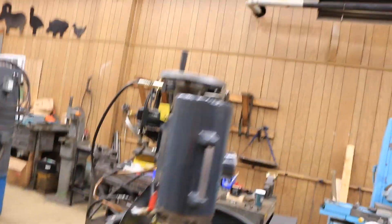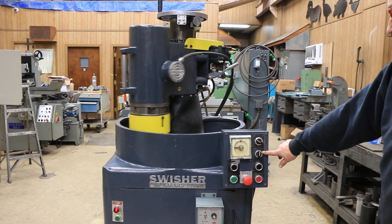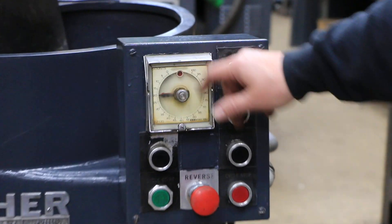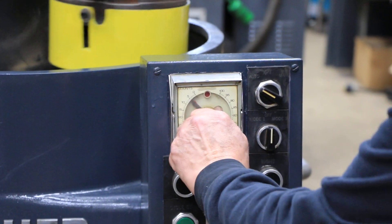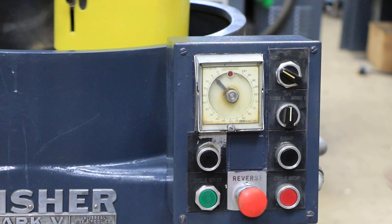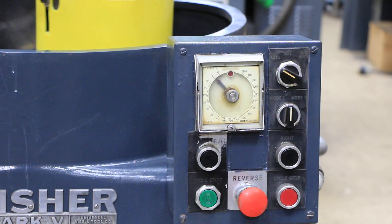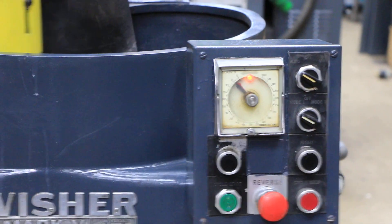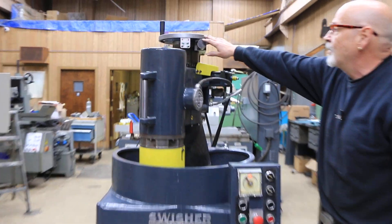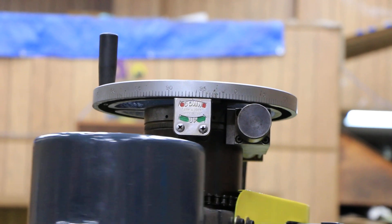When we walk around to the front of the machine, it's going back and forth, but it's not feeding right now because I haven't selected the downfeed mode. There are two downfeed modes — remember we talked about this. The first mode is going to feed; I don't want it to feed 20 times, so let's go up to five. And the other mode, it's going to go back and forth five times before it feeds. So now we're going to feed every time — it has to go there and then back again before it feeds. It doesn't feed on both sides of the workpiece, only one side. Now you see the red light comes on, and if you watch this wheel up here, when we get to this side it snaps to the next increment — that's about a thousandth or two thousandths.